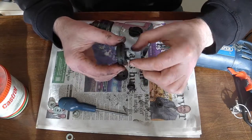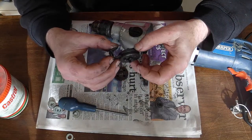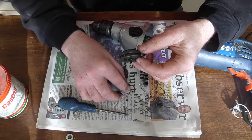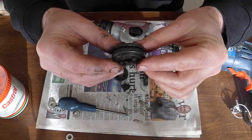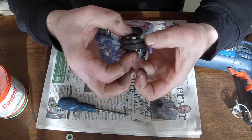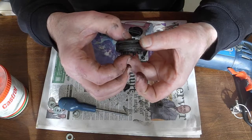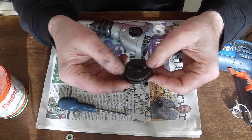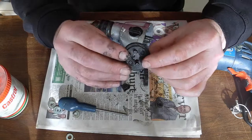This is the selector. The design is that it sticks in there and then you turn the switch and that slides up and down, moving the selector. There are these two pins in between - they're free to move and they stop the two cogs from getting close together and engaging both at the same time, so you can't get both gears engaged simultaneously. These other two engage the lower gear and they're sprung so that you can engage the gear without it being in the right place, and then as it spins around they will pop down into the holes.